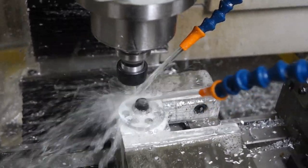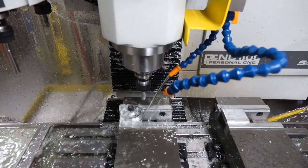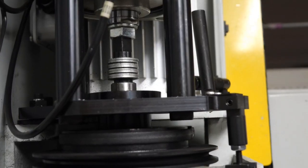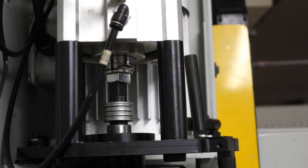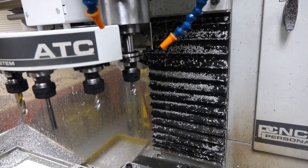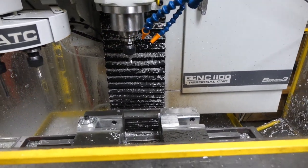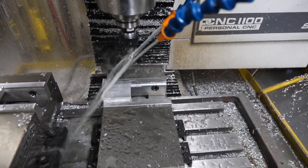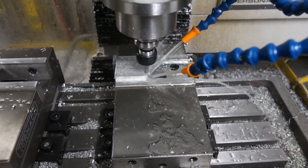The major limit on the Tormach with automatic tool changer is the power drawbar. It doesn't hold the tool rigidly. It holds it in a kind of a weird backward system where the collet is closed by these Belleville washers and then released by a big air cylinder. So if I take too big of a cut, the tool pulls out of the collet. It's been a balancing act trying to figure out how fast I can actually cut parts while maintaining tolerance without pullout.